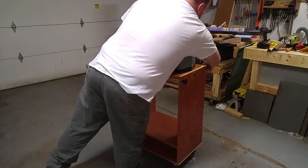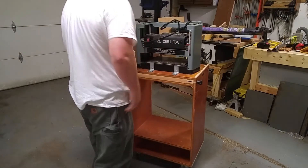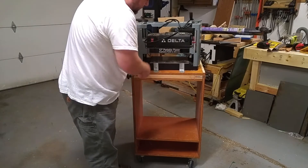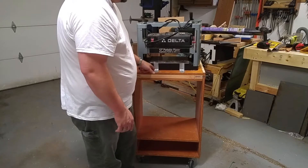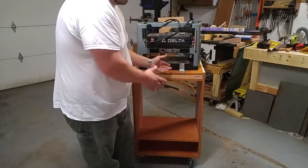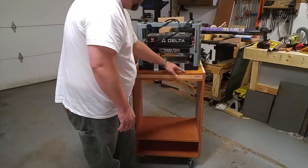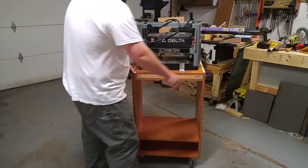One of these slots is a little small but it goes in there. On this, I had to make some mounting brackets because there's no place to bolt it down. There are like four holes inside, and bigger holes where I could probably run some long bolts through, but I didn't have any. So I made these brackets using a machine screw that threads into the side for the outfeed supports — which didn't come with it when I bought it used. I cut these pieces of steel with my angle grinder and screwed them from this base to this top.